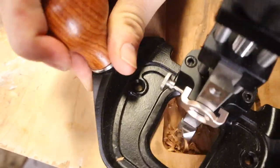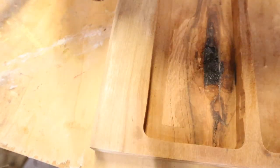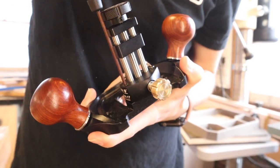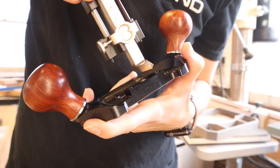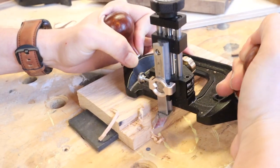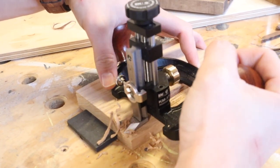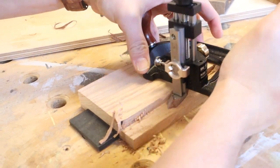This is another catch-all I made using a router, and routers are just notoriously inconsistent, especially if your jigs are handmade and you don't have a steady hand. Another really cool thing about this router plane is that you can flip the cutter backwards — that way if you want to pull towards you and make cuts you can do that. That's really useful if you can't get the right angle or just don't have enough power. This piece of oak was giving me a lot of trouble with a chisel because it's a really tough, stringy, hard wood, but having the router plane pulling into myself with the 45-degree blade was really easy and made for a nice clean recess.